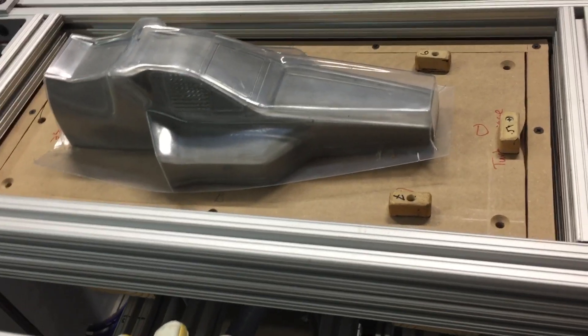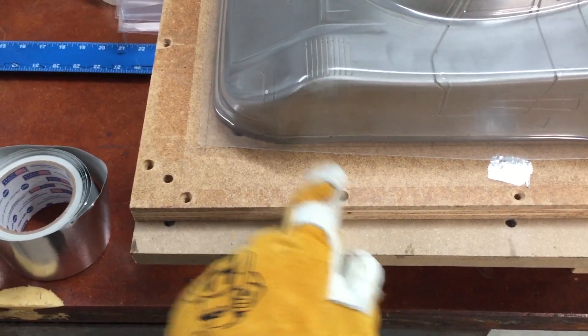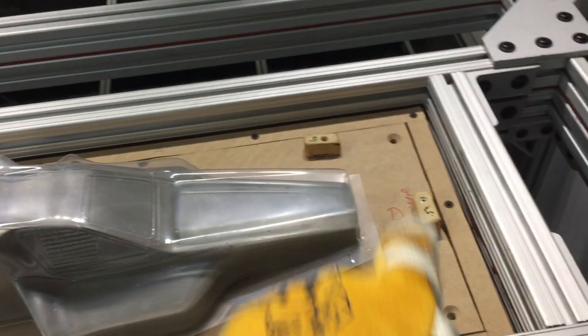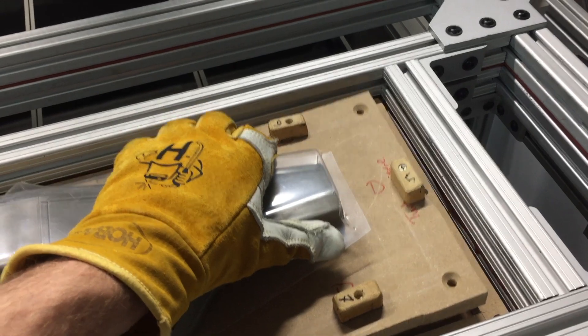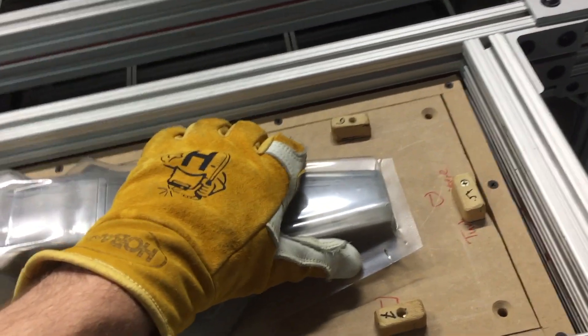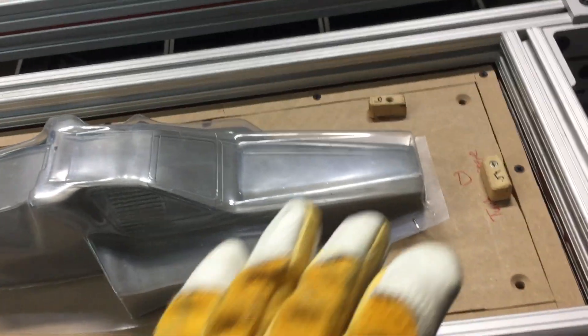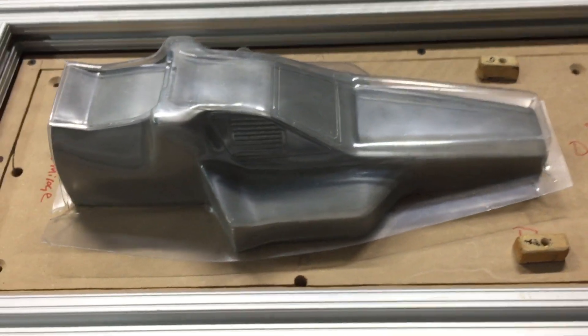This is my new design. I've got a platform in the medium size, using the exact same sheet dimensions as before — I've just changed the platform design. Here's the smaller one I've done, and this is using a ring basically instead. The platform the mold and buck is sitting on right now is actually the waste material from cutting this out. They fit in nice and tight. And I don't need the tape at all. The benefit is that when the vacuum is drawn, it's drawing up here which helps evacuate air through here, gets a good seal on top, and when air ejects it assists in pushing the plastic up — so it works a little bit better.